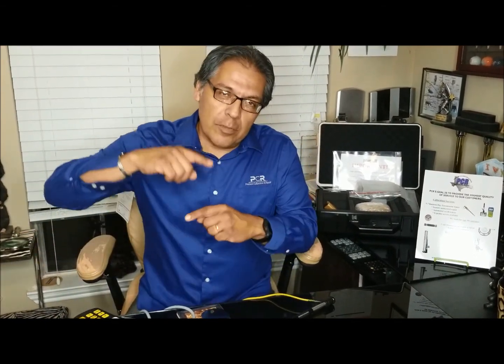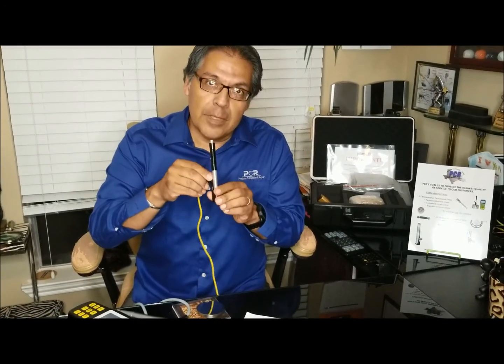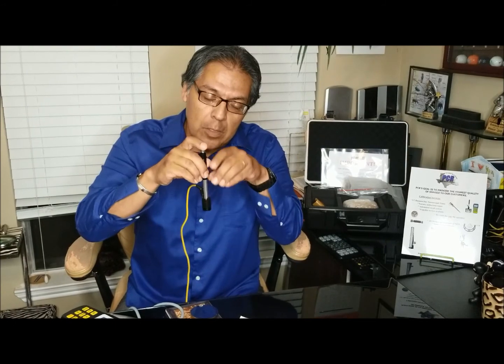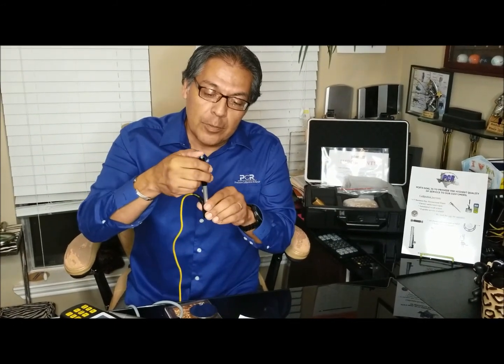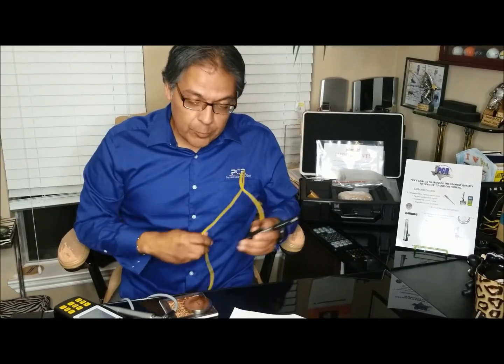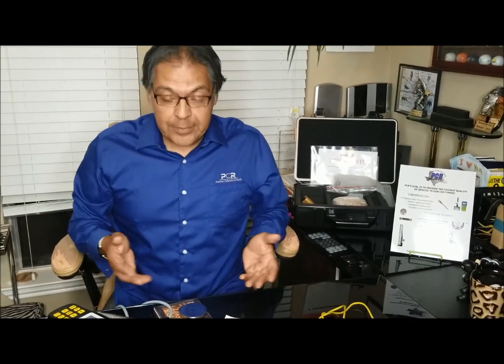That style works off a rebound. Here is the Leeb impact device. You would cock it like that, with the carbide ball on top, hit the release, and the ball would bounce. This part is way too small, doesn't have enough thickness or mass, so you're not going to be able to get an accurate reading. What do I do if I have a part that's smaller than an inch and I want to go portable?